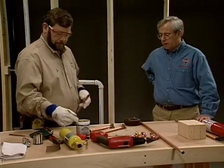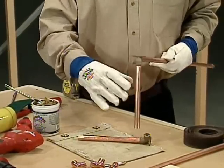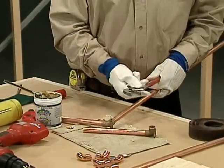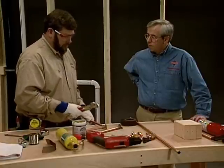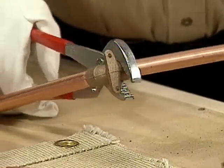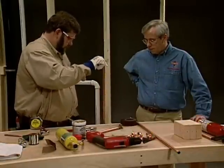I'll show you a little trick. Normally when I put this together, as I'm soldering it or trying to hold this thing flopping around, I could pick it up and this could fall off as I'm heating it. So to help prevent that I'm going to use my channel locks here. These fittings can actually crack if I squeeze them too hard, so I'm just going to put a little pressure on these and try to egg the fitting just a little bit — make it slightly oval. When I do that I can turn this and it locks down pretty good, so that pipe when I hold it there won't fall out.